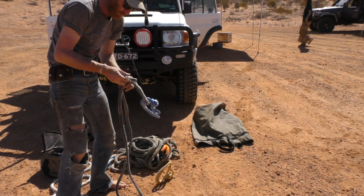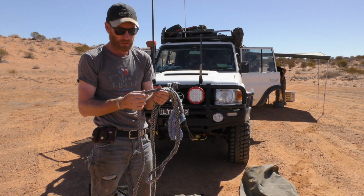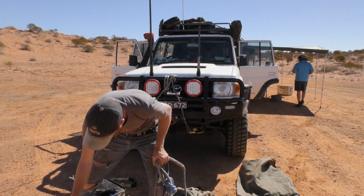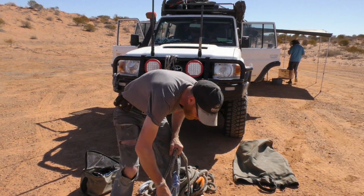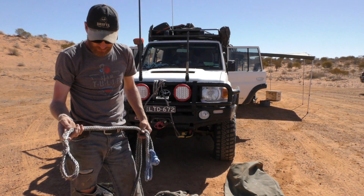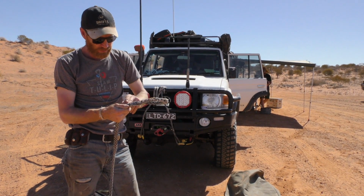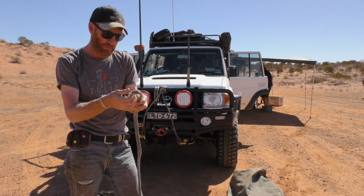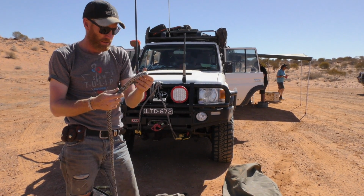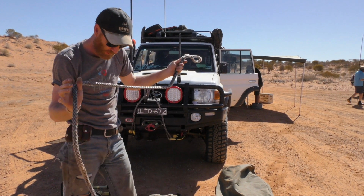And it's holding up really well. It's got a pretty high percentage polyurethane coating, so it's a lot stiffer. You can see how soft the other one is, eh? It's totally floppy, almost like a cowboy lasso rope. And these joints, I'm doing a three splice join. Inside here, very little wear. You don't need a sleeve inside that, so that's going really well.